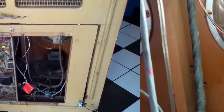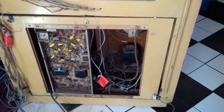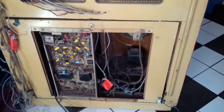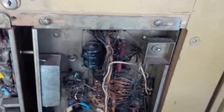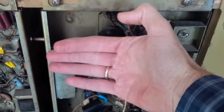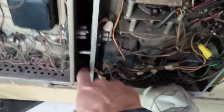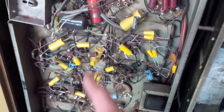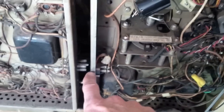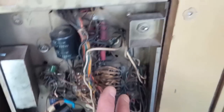Boy, oh boy. Okay, so that's it with the back tipped back up, and I'm ready to put in the selection receiver. Okay, so the selection receiver is in place, and you can see that it has these slots so it can slide this way, and when it does, this pin and the pin here line it up with the amplifier. This is the high fidelity amplifier, and there's also a power plug that will get pushed into this receptacle here because all the power comes from here.